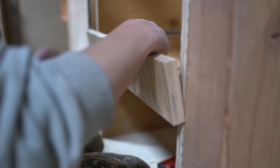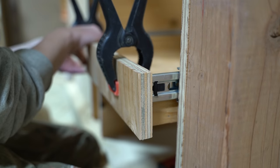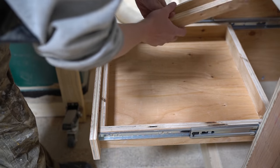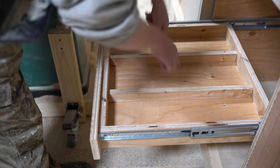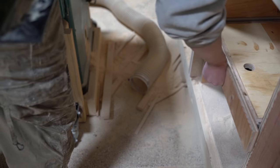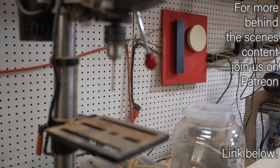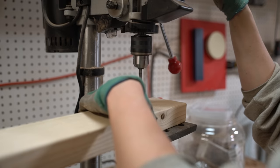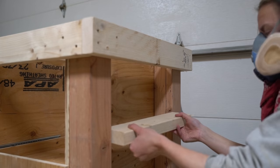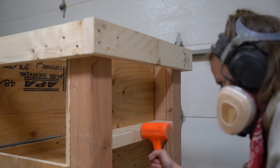After that I whipped up a quick drawer face and a few floating dividers to keep my trim bits away from the big router bits and all the bolts and hardware. I chose to enclose the drawer as it'd be sitting below a mega dust maker, and opted for two separate panels so I wouldn't have to find a spot for a big annoying panel anytime I wanted to find a bit. Next I turned to another organizer piece — finding the dang wrenches in the drawer is like finding Waldo, so I used the drill press to sink a few slots in a 2x4 and then anchored it between the legs of the bench.